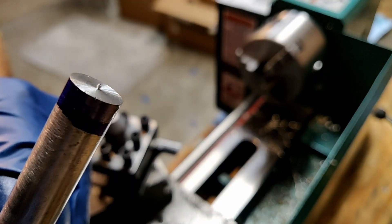Unfortunately I'm still learning the proper feeds and speeds for different materials, and on aluminum I am getting a pretty rough finish that you can still feel with your finger. The marking fluid is still present, which was caused by removing the piece from the chuck — that lost us concentricity from our original setup and marks a low point in the material relative to our new setup.